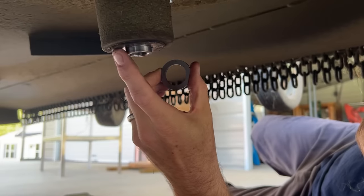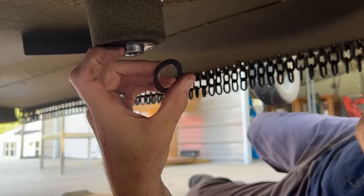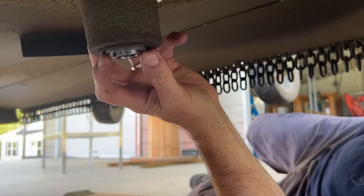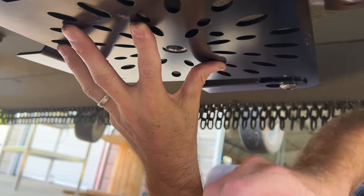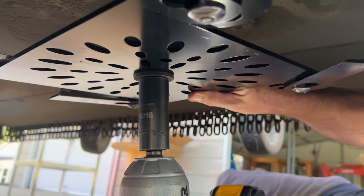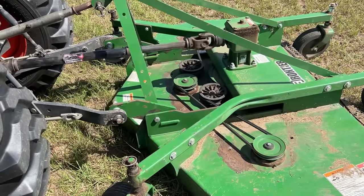This is what we're talking about with the spindle fitment. This land right here sticks out too far, the blade is too thin, and the bolt hits this land before it hits the blade. So these are the spacers we use. When I put the spacer here, there's less land showing. Now I put the blade up and the bolt can tighten without bottoming out on the land of the spindle. There's no clearance issues there and no clearance issues tip to tip. She's going to engage the PTO and see if it makes any noise — no problem so far. She'll go up to 540 RPM and mow a couple of strips for comparison.